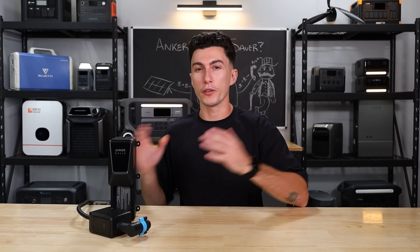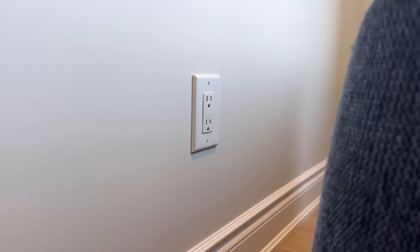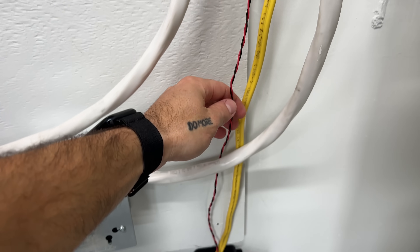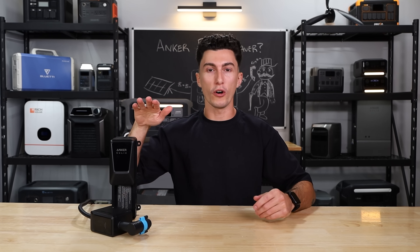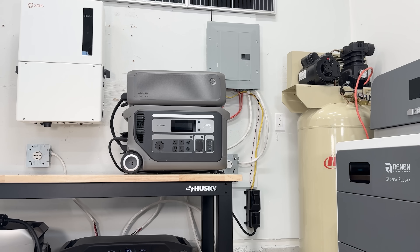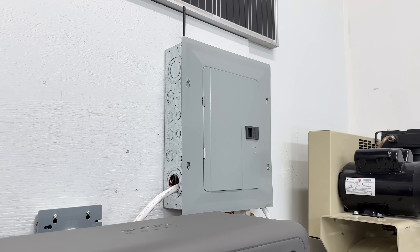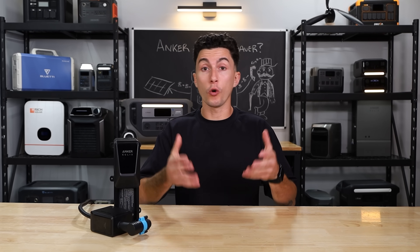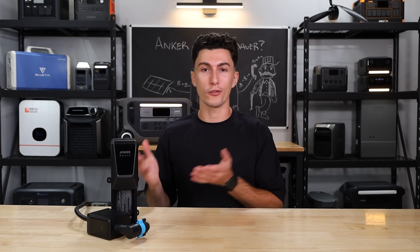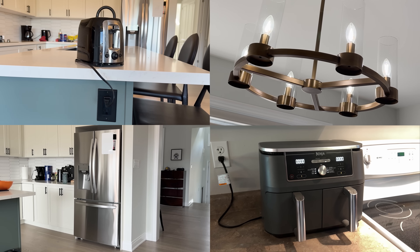When it comes to things we don't like, the first is that they kind of advertise it as if you could replace an outlet in your home with this box, but it needs communication cables run. So not only would you have to assume the outlet is already on 20 amps with appropriate 12-gauge wire, you'd have to somehow run a communication cable through your existing walls to get to your panel — it's not really practical. The only real-life place you'd mount this is just below or beside your existing panel. They position it as a whole home backup solution and say you could power a sub-panel or even your whole home, but the reality is with a 20-amp circuit and 12-gauge wire, even if you had two of these running 240 volts, you're only backing up a few critical loads — not your whole home, especially if you have bigger appliances.